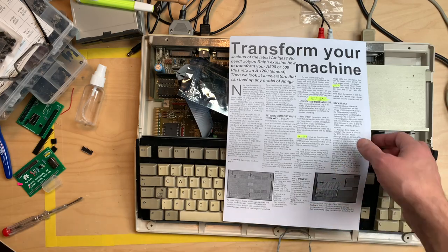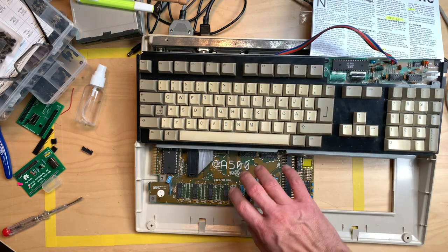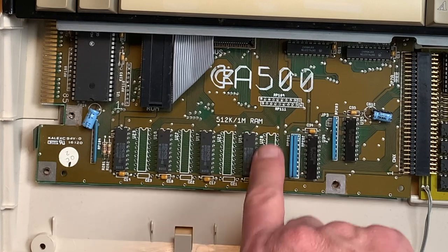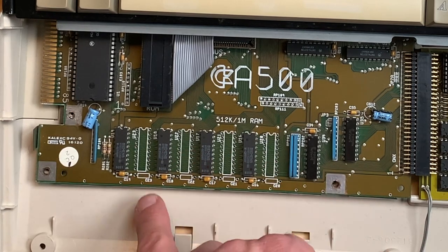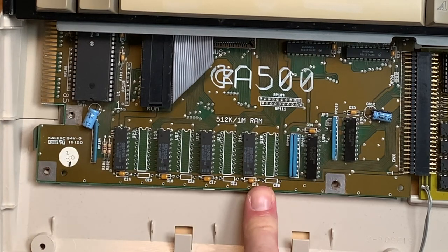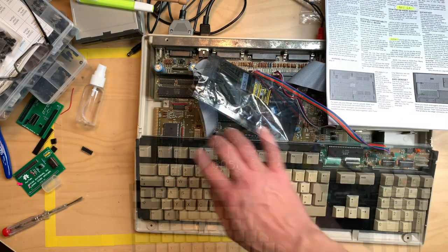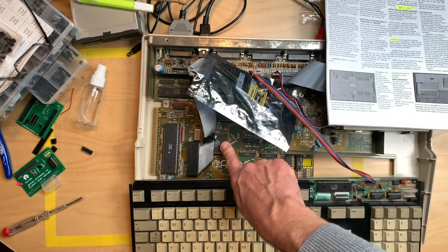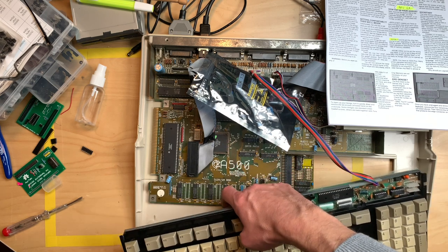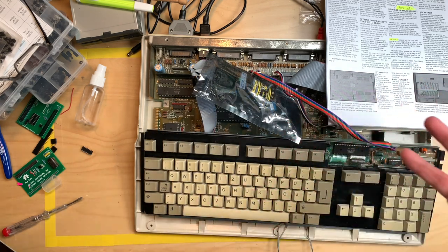But what we can do is add some RAM to this, and I used this board specifically because all the holes for the RAM are free, they are not soldered, so I will put sockets in here. You have to put some caps here, and we will put in the SuperDenise up here. And currently there's an 8372A here, which will enable the 1 meg of chip RAM if we put in the RAM chips. And using the SuperDenise chip will give us better graphics modes.